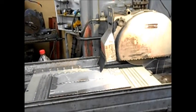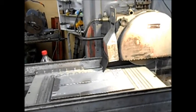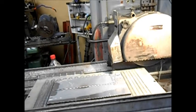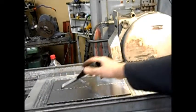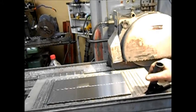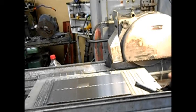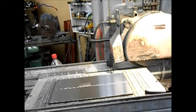So here we are again — I've just finished grinding this one side. I'll turn that coolant down and park the grinder right over in that far corner so it's out of my way. I've actually got one there that I haven't quite fully cleaned up. I'm a bit worried about my thickness, so I'm going to leave it — I can make it one of the end blocks. Hopefully it won't move too much when I grind the other side. It's one of the end blocks, so it shouldn't matter. This one is measuring about 502 thou, so I've still got a couple of thou over.